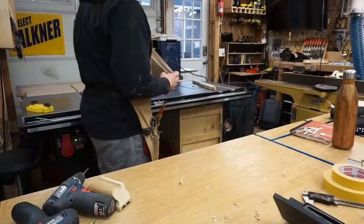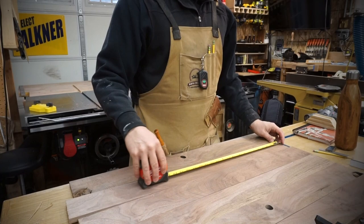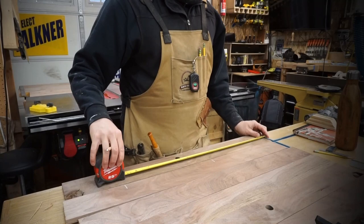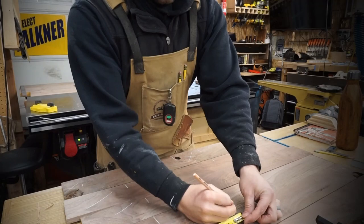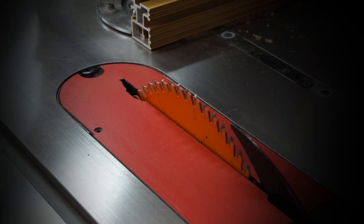And after proving why you're in the wood shop instead of on the hard court, you can count out how many pieces of wood you have. In this case, it's 1/2 inch black Oregon walnut. And I mark it out with a white chalk pencil to avoid any knots or other imperfections, to make sure that you have the right size pieces for that box. I like to use a white chalk pencil because it shows up really well, and it's easy to identify when you go to cross cut it on the sled.